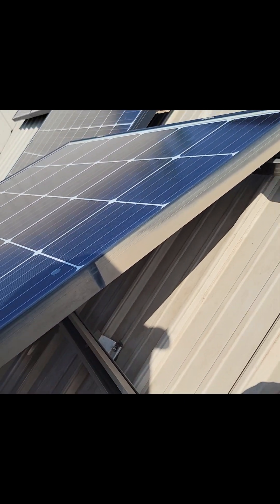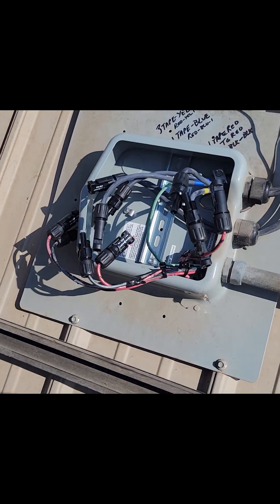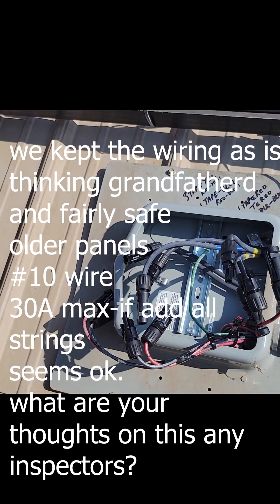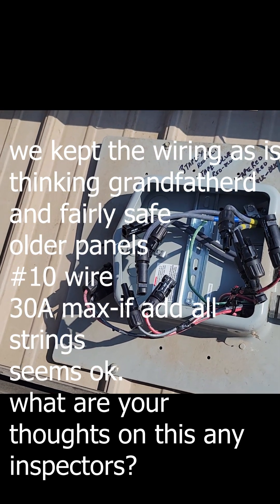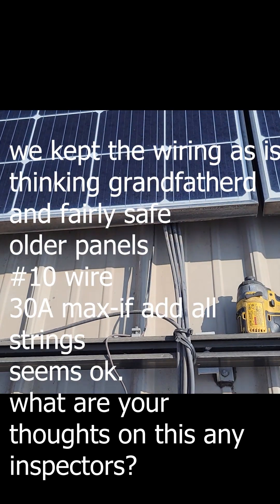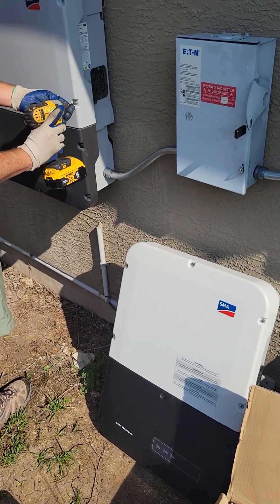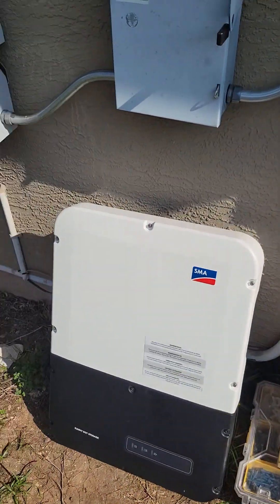That's the two-tape that goes to yellow and the one-tape goes to blue, for my reference. Now we got them all unplugged so they're isolated. There's high voltage DC - it turns out there are three strings, plus and minus on each string, around 300 to 600 volts typically. You wear your hot gloves when you're working on this. Grounding looks right, looks pretty good.